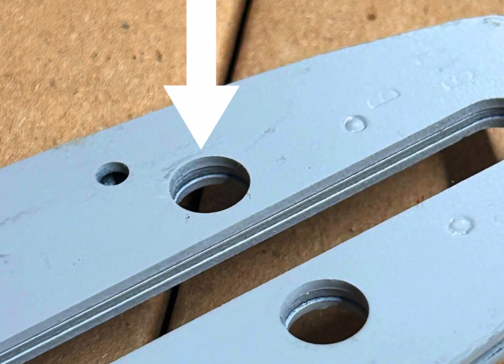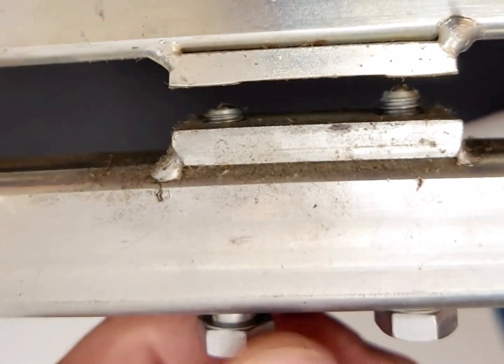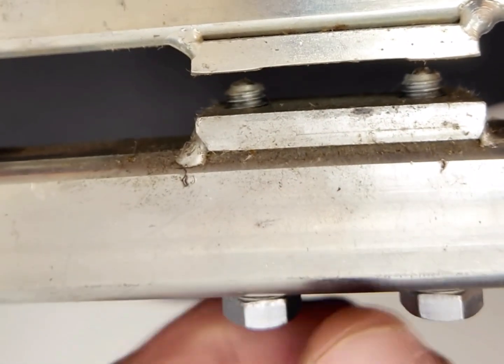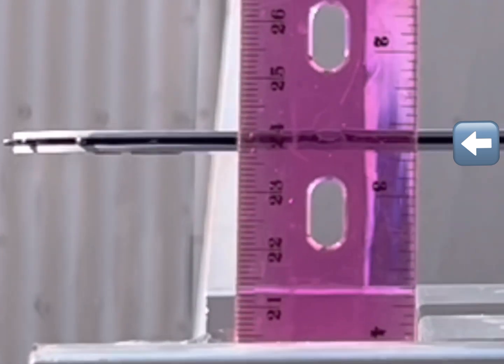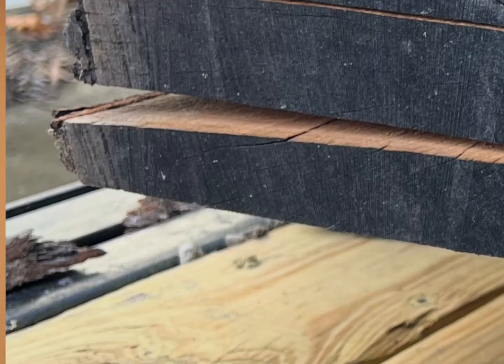So a laminate bar is constructed of three smaller pieces of material, either glued or riveted together. And they can collapse as the pressure bolts come up. And what that'll do is it'll force the nose of the bar away from your mill, as you can see in this demonstration. Obviously, this is less than ideal if you want a perfectly parallel cut.